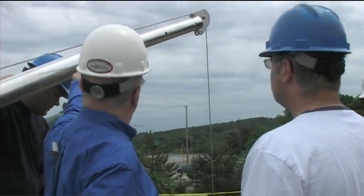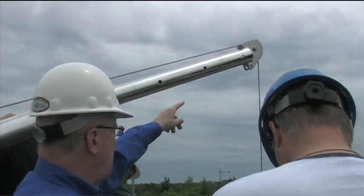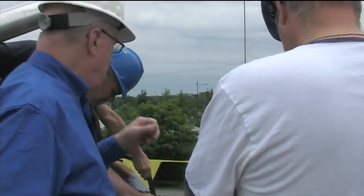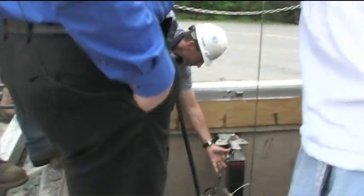See the four stops here? We're on the fourth stop, so it's out as far as it can go. The wire rope assembly should be completely plumbed. If it isn't, you'll have difficulty pulling the mixer up.